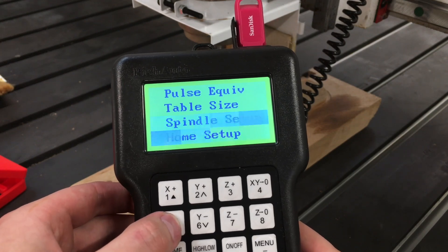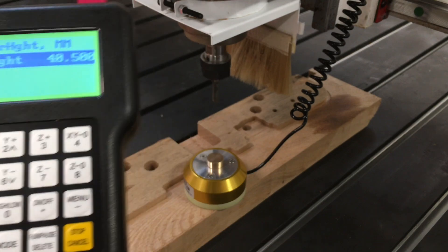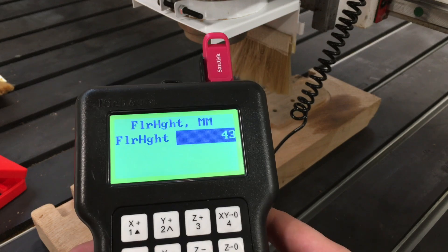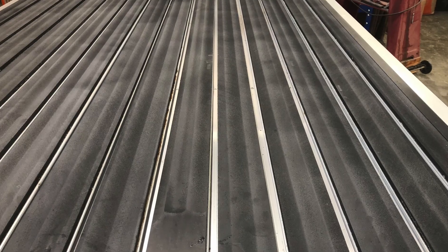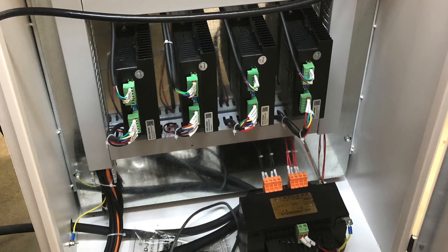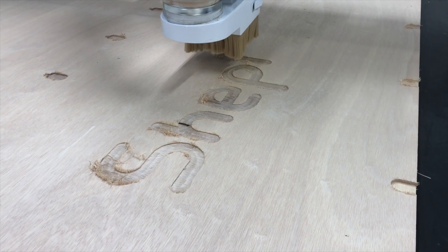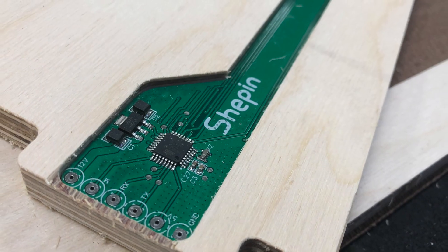In conclusion, the total cost of this machine, including any cost required to place it into my shop, was $8,363.16. I strongly believe that this is the best value for your money. I was truly impressed with the quality, precision, and build of this machine. There are only a few minor issues. Number one, sometimes the oil drips from the rails — if this continues to be a problem, I can add a small gutter, but it would be nice if it was added as part of the machine. Second, the table was not perfectly flat, but it was an easy fix simply by running a surface bit all across the table. Lastly, the spindle speed doesn't automatically adjust to your G-code — you have to set it manually before you run your code. Otherwise, I'm very satisfied with my purchase. The product is truly the best based on its price. All of the mentioned companies, products, and references shown in this video are included in the comments section. I hope you find this video helpful in your research. Thank you for watching.